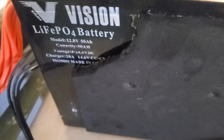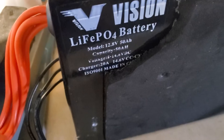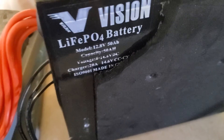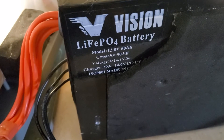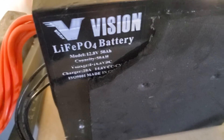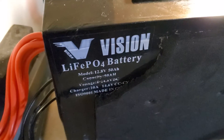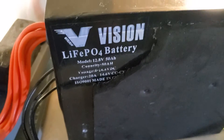It should be reading 13.8 volts. It does charge — I checked and there was 14.85 volts coming out of the unit. But trying to charge the battery after it has been sitting so long, it's not taking a charge anymore. I'm going to take this battery pack and try to locate replacement batteries.